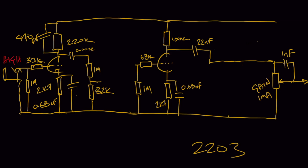With a DPDT, you've got one side of the switch you can use for something else — maybe as a ground reference for LEDs on the front panel. My single pole double throw switch has three terminals, and my switch is set to that side. I want the output of this extra gain stage connected to that terminal.